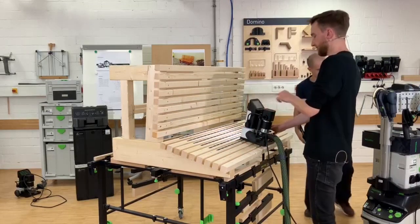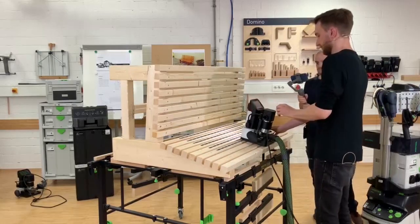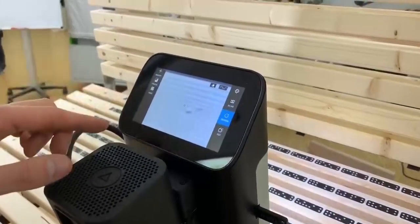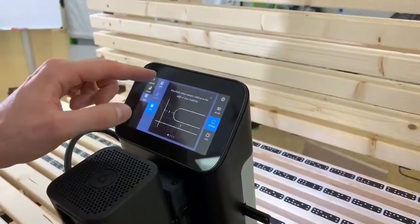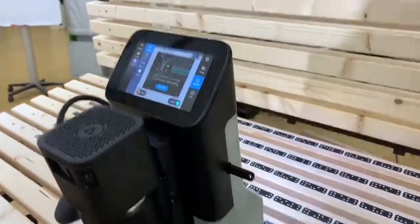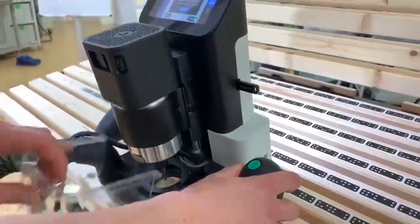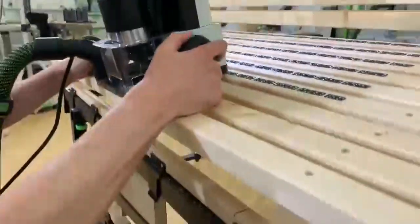All right. Maybe you want to quickly capture this one because I think it's quite neatly solved. So how do I place something accurately in the middle, right? I will use the grid mode. I start a new grid and I will use the cutter, which is here a 6 millimeter up spiral bit cutter, to probe my workpiece. I define the depth by pressing the green button. So I will lower the cutter.